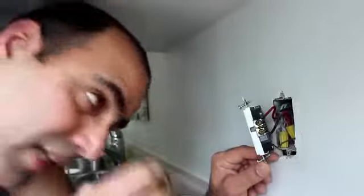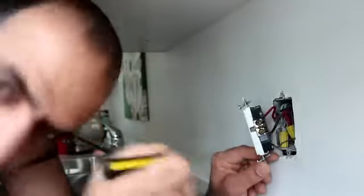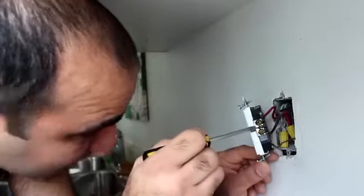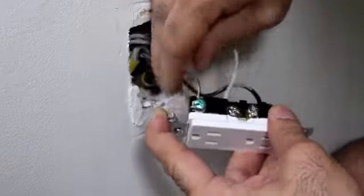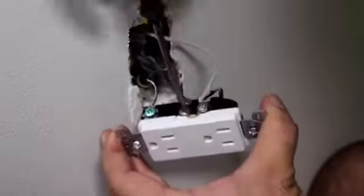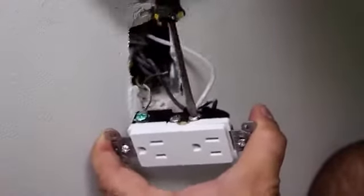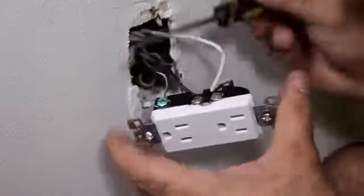In some of the outlets, especially in the kitchen, they bring two phases to the outlet. And to do so, if you look here carefully, they have to cut that tiny bridge. Damn it. I have to learn to open the breaker. So connect the ground. Also tighten these screws all the way down so they are not hanging out for no reason, shocking people like Trump on Twitter.